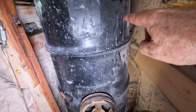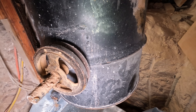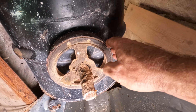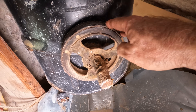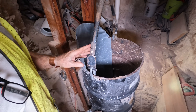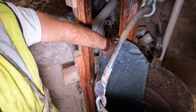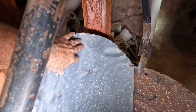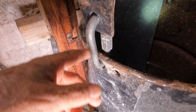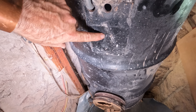This is a 30-gallon drum — brand new, not repurposed, because that's very important, and I'll explain that here in the middle. And these are harmonic balancers off of a Chrysler — a lot of you guys figured that out. This bar is called a trunnion, this is called a bale, this is what connects the whole thing together. And then we welded an apron on the front here. The bale is connected to the bucket with these D-rings right here.